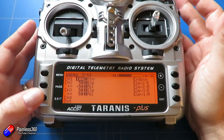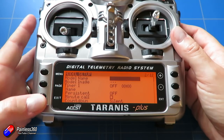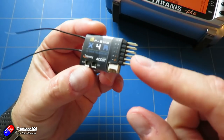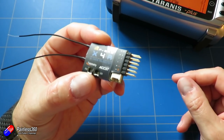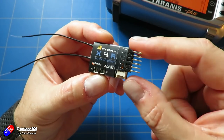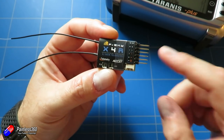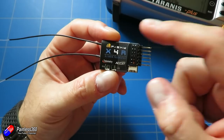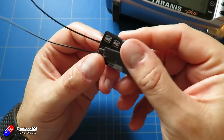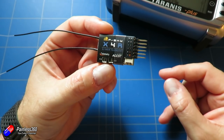Now I'd go and bind it to a receiver. The receivers we tend to use for quadcopters are little small dinky things, but with planes we need to be able to plug the servos and speed controller in. I tend to use things like the X4R or similar ones with multiple outputs. This actually has four outputs, one of which is S-Bus - we won't use that because we only need three outputs: channels one, two and three. Let me bind this to the radio using the D16 protocol.